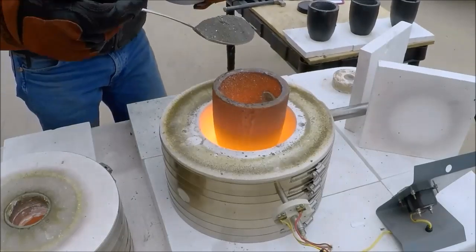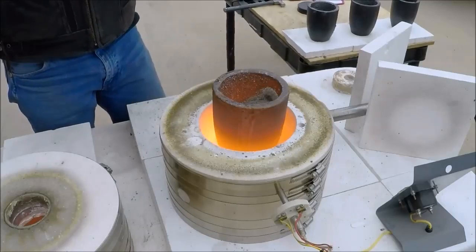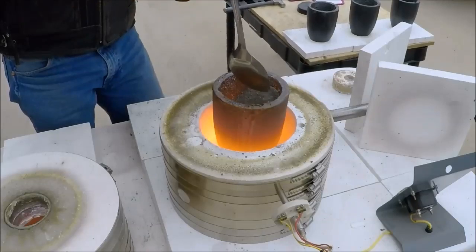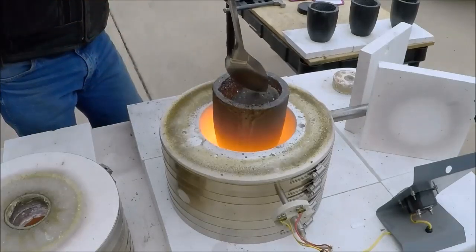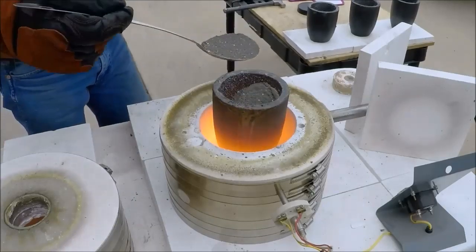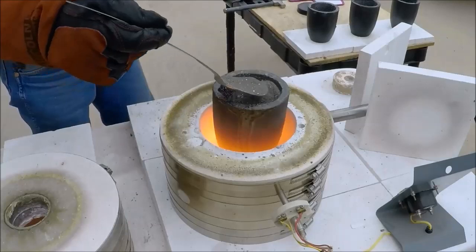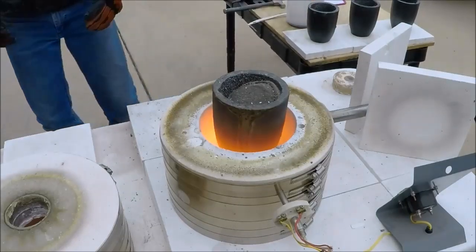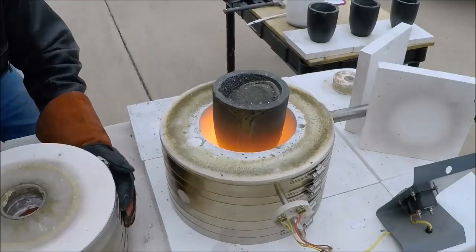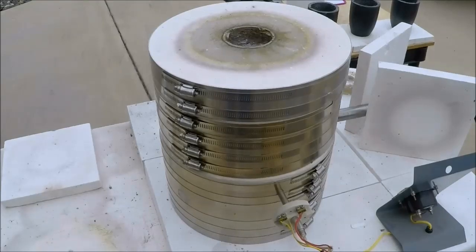What that does is leave a little gap on this side of the crucible where gases can get out and not form a cap. If you just keep stacking it up on this side, it kind of bolts a little edge. It'll trim your eyebrows. So that's about all I want to put in right now - a little bit too much and it just dusts around and blows all over the place and you lose it. Stack the kiln back up, away we go. So you can add to your crucible as long as your material's dry and as long as you're careful and stack it off to the side. Thank you so much.